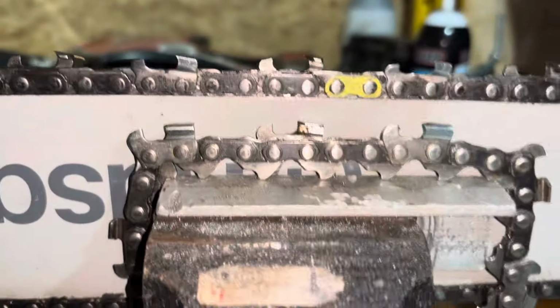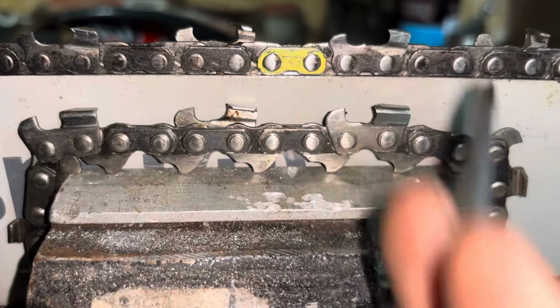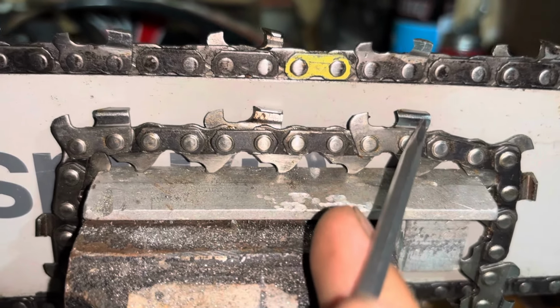So, hello everybody, this is the next video in my series of videos on chainsaw chains. Today's video is about semi-chisel chain, which is right here, and the full chisel chain, which is here on top. The difference between semi-chisel chain and full chisel chain is the actual profile of the cutter head.